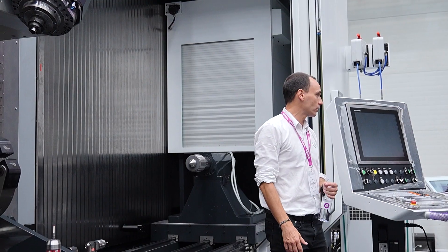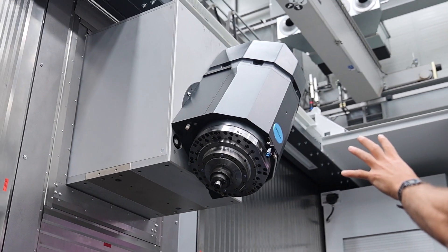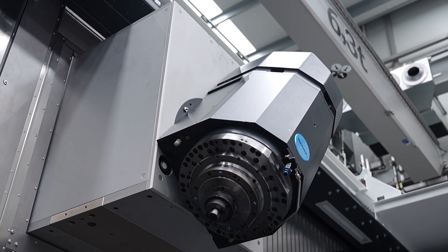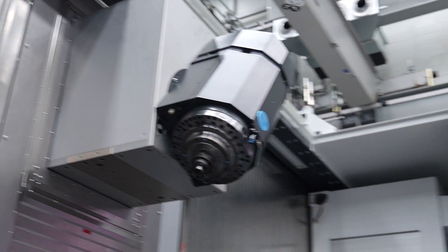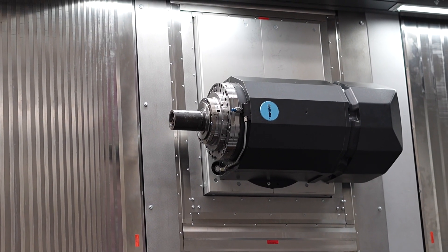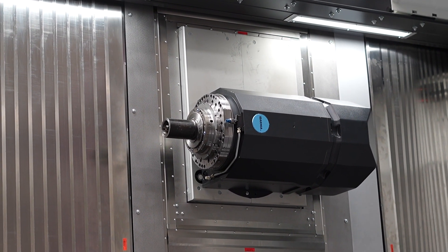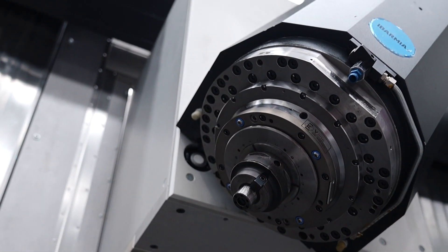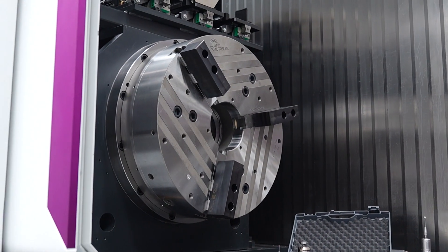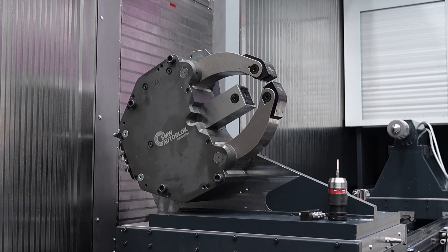What I love is that you're using your top milling technology in the back of the machinery here. We have a spindle here that you don't normally see of that size — about 75 kilowatt spindle on a turning machine. So you're using your top milling technology on the front, which means you can just stick a really big part on with two steady rests and a tail stock, or maybe three steady rests. We've got a strong milling capacity here: that big spindle with 75 kilowatts power and 12,000 RPM on a Capto C8 tool taper, combined with the items we put on the front of the working area. That multitasking spindle with the steady rests and tail stocks can be moved along the X axis so you can set up different jobs — parts of different lengths along the whole working area.